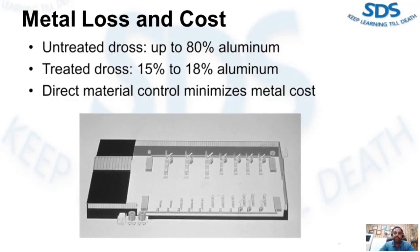For example, if you start with 1,000 pounds of metal and each time you melt it you lose 5 percent, after five meltdowns you will have 773.8 pounds left — a loss of 226.2 pounds. At a cost of $0.50 per pound, this equals a loss of around $113, and you may not have produced good castings. Direct material control is very important to minimize metal costs. In most die casting operations where you just cast, trim, and ship, metal cost is 55 to 65 percent of the cost of the part.